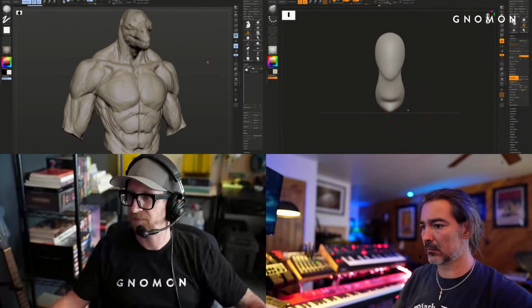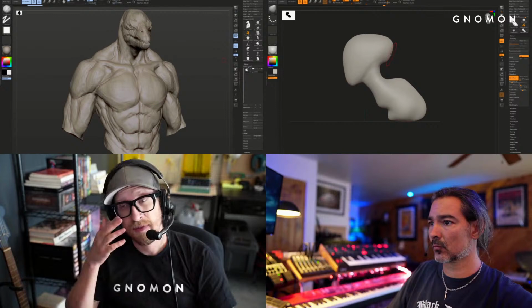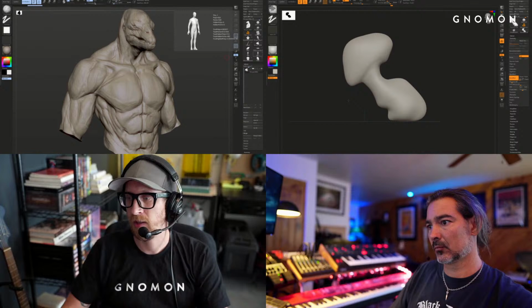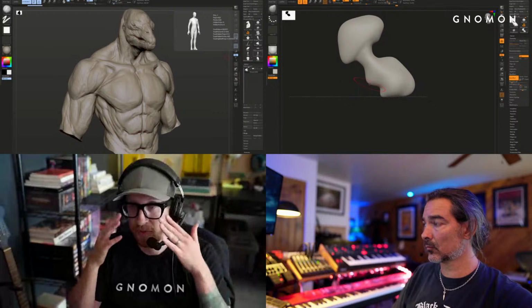And then for the people doing it yourself, I saw some questions about, is it safe? Do you want ventilation? I would definitely want ventilation. My office is in my garage, so I have plenty of space to open up a door or a window and be fine with that. But the resin printers, at least the ones that I've used, the Anycubics, the resin has a definite smell to it. And you definitely want to wear gloves, and if you don't wear glasses, have some sort of eye protection. You do not want to get resin in your eyeballs. So wear stuff to protect yourself.